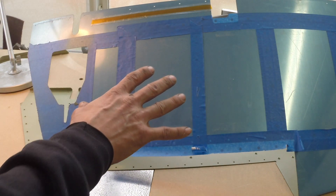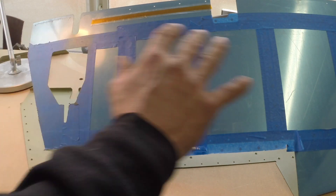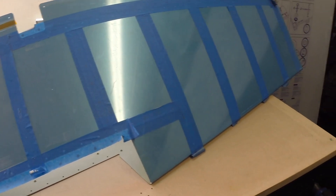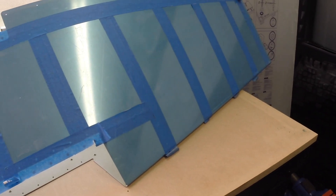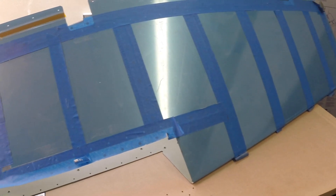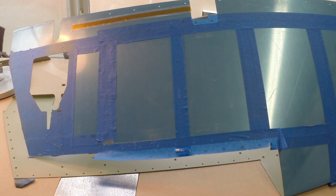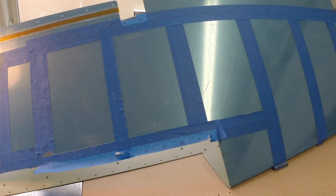I've got the tape back on these, and what I'm going to do is back rivet all of these stiffeners in, then go around and inspect everything, look for bad rivets, and then we'll basically have a rivet drilling-out party — get the few that need replacing all drilled out as one big go.